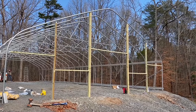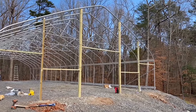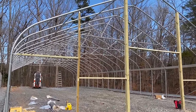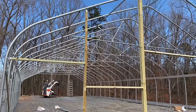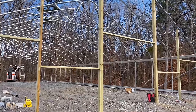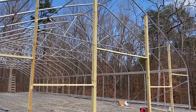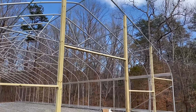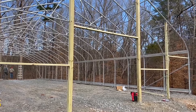Now you can see the whole thing. They've constructed this wooden frame that will house the eight-foot rolling door on both the front and the back. They still have some more structural support and bracing to add. They used a bunch of two-by-fours, and the main posts look like either a four-by-four or six-by-six. That opening uses 16-foot long boards to hold and house the barn door.